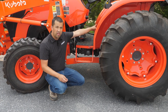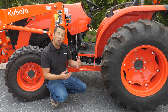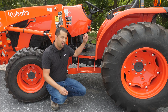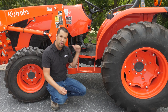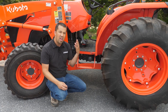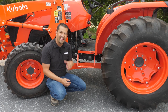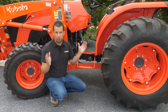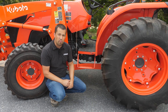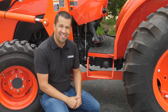Now, you'll notice I started with the rear PTO on this tractor. As you go through the spec sheets of some machines, you're going to find that more deluxe tractors are going to have mid PTOs. Those machines are going to have an extra gear set in the transmission back here. It gives you a PTO option pointing forward - that is specifically made for this exact application, for when you're going to have front attachments, normally a snowblower or a broom, that needs to run off of those spinning shafts feeding from the back. This is one of those things that's going to differentiate a deluxe tractor from a standard economy tractor. Those gear sets add expense, and so your more expensive, more deluxe models often come with those as standard equipment or have them as options, where the economy machines like this MX did not.